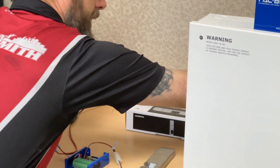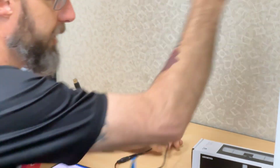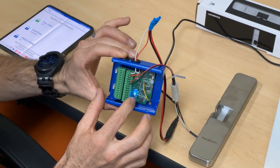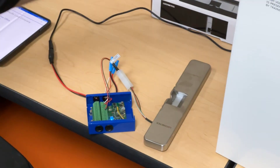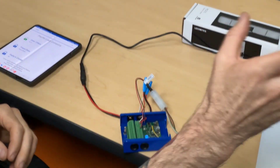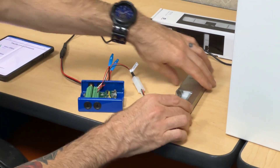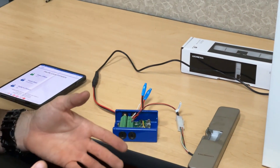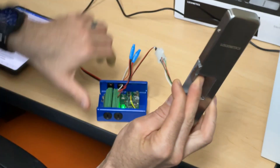I'm going to actually unplug and plug in the transformer to this unit that we're going to unlock right here, and as soon as I plug it back in it pretty much comes right back online. You can see the different colors, and as soon as we're blue, we're good — we're back to where we need to be. It condenses all of this down into a very small access control package that gets mounted at the door instead of this giant can. It's smaller, it's more compact, literally just two wires to provide power and two wires that go to your strike. You can wire it fail safe or fail secure, and you can do 12 or 24 volt.